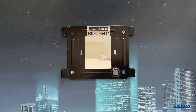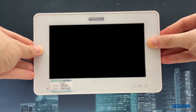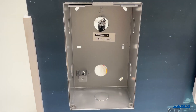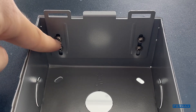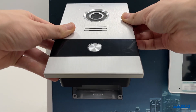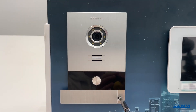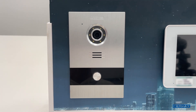We will begin by anchoring the monitor to the connector of the kit that we have fixed on the wall. From top to bottom, we will insert the four slots in the bracket and slide. Now we are going to show you how to fix the MILO panel. We will make the connection of the panel, giving it power through the Ethernet cable of the switch. Once the connection has been made, insert the panel into the flush box. In the upper part of the box, we will be able to regulate the projection to place our panel more easily in case we need more space. We will hook the upper part of the panel into the depth adjustment hook of the flush box, and then the lower part. Then we will move the sliding tab of the panel to fix the screws to the flush box, leaving a minimum of 1.7cm of free space to insert the screws. In this way, you will have already installed the monitor and the NEO kit panel.